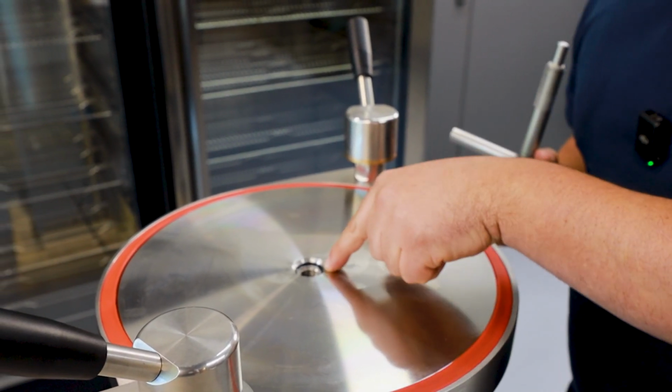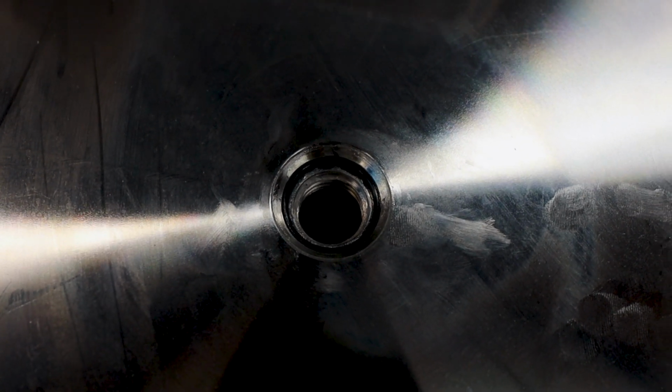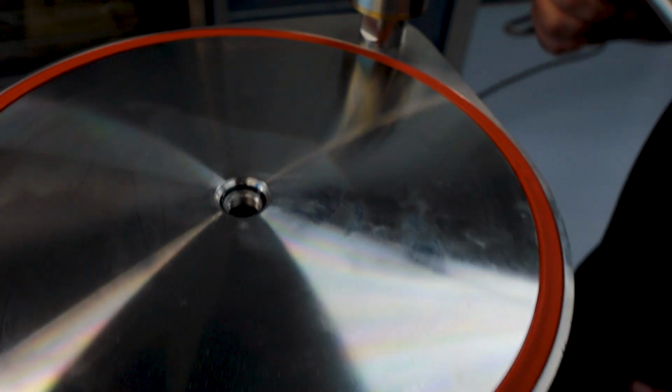And then you can see the hydraulic shaft in there. So what you're gonna do is you're gonna press the knee lever in towards the unit. It's gonna separate from the hydraulic shaft. Count to five. Stop the knee lever by pressing with your hand because it'll be stuck into place when lowering it.